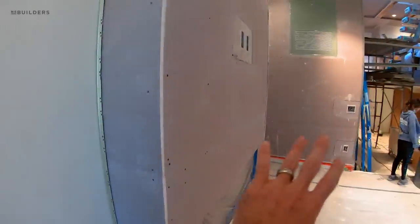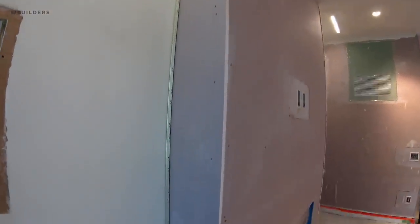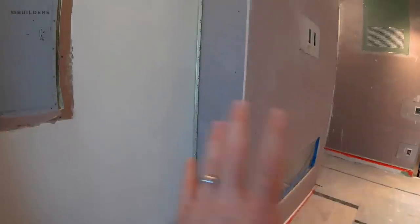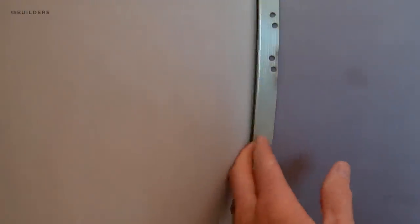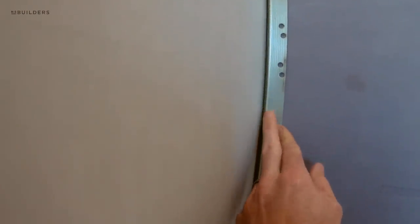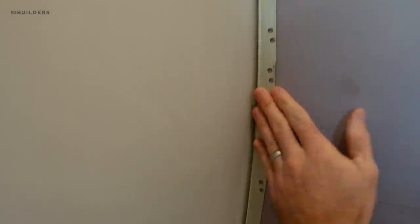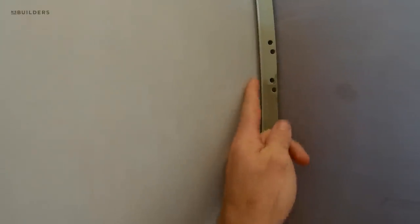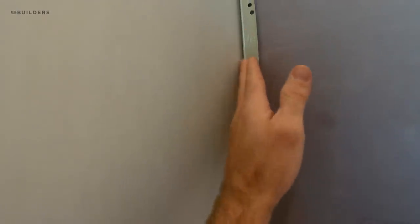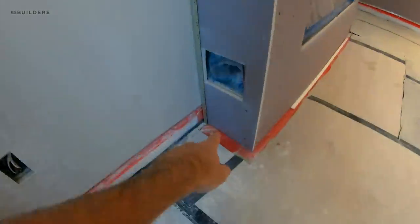So this is actually gonna be a concrete look, a marble plaster, and we wanted it to be its own volume. So we've separated this with an intentional shadow bead here. Steve's installing it. And this will give a nice hard stop bead for that marble plaster to come up to. So we're not trying to have this really clean, almost like when you paint two surfaces a different color, you get that kind of wavy line. This gives us a really nice intentional stop. We'll do the same thing at the floor.